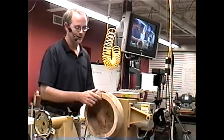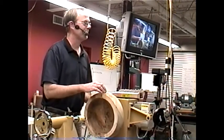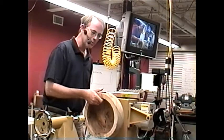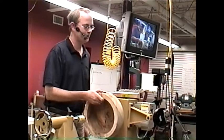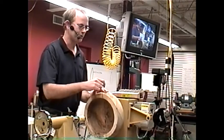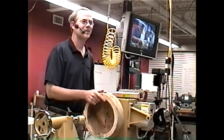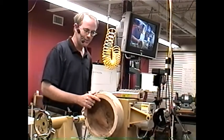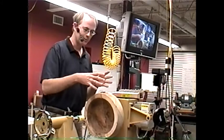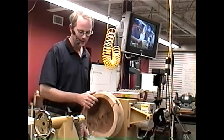It's a learning curve — try smaller ones first, then go bigger. You can do inlay on the inlay, have double bow ties, have them crisscrossed, however you want. I recommend chiseling the corners rather than rounding them — I just did it rounded because it's quicker and I didn't think anybody wanted to see me chiseling all night. It really looks a lot nicer when you chisel out the corners. End grain is pretty weak — it wants to pull apart, which is what this one did.